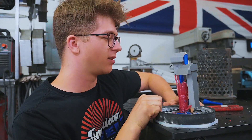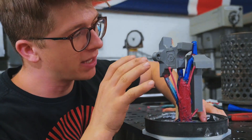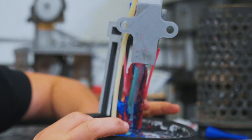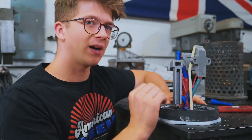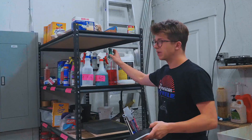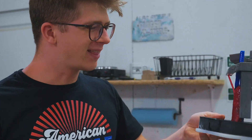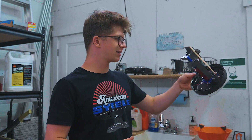PLA plastic does not like getting wax stuck to it - there was a huge struggle getting the sprues to stick, but it's done. We have it sprued. We have one vent coming from the bottom, and I'm quite confident that this ugly mess is going to work quite well. Both parts are going to be cast at the same time. Before I mix up the investment, I'm going to put some debubbler on, because debubbles are no fun. This is some sort of liquid that decreases the surface tension of the investment - it supposedly, maybe and potentially, will give us less bubbles. Less bubbles, less troubles.